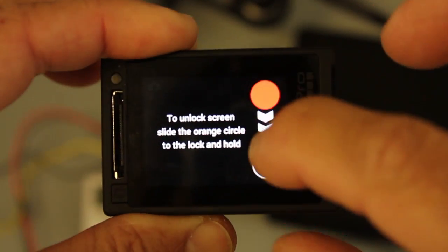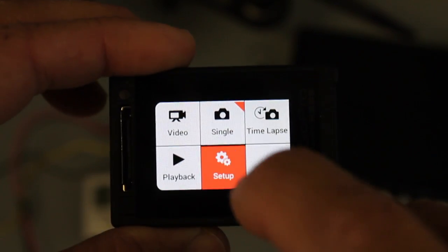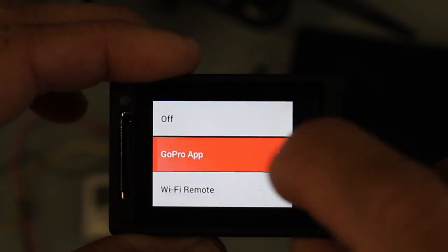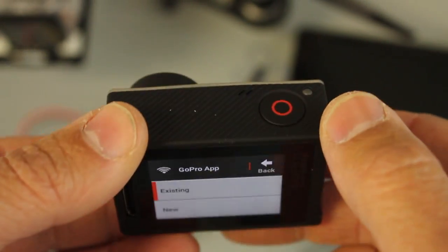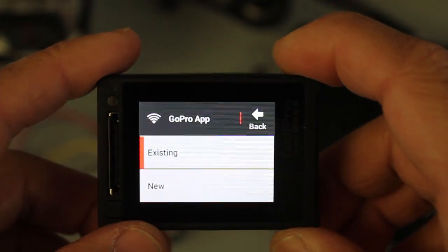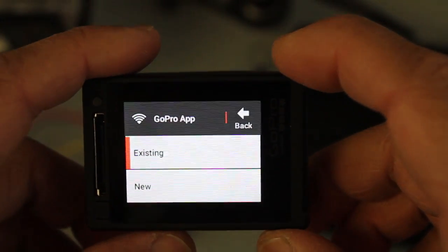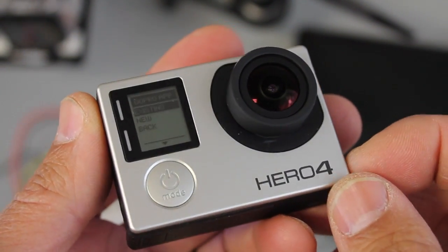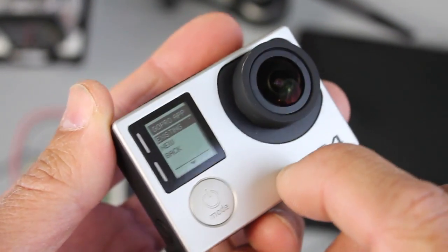One last option we had with this camera — the little LCD screen on the Hero 4 is awesome, and you'll notice it has Wi-Fi capabilities. One option was to use the GoPro app while in the air to basically get video back on an iPhone or iPad. The reason I'm reluctant to do that is Wi-Fi is on the 2.4 gigahertz spectrum, and so is the FrSky Taranis or any 2.4 gigahertz transmitter. I've read forum posts of people saying there is interference and there isn't, but for me I just like to play it safe, so I'm going to opt not to use that option.